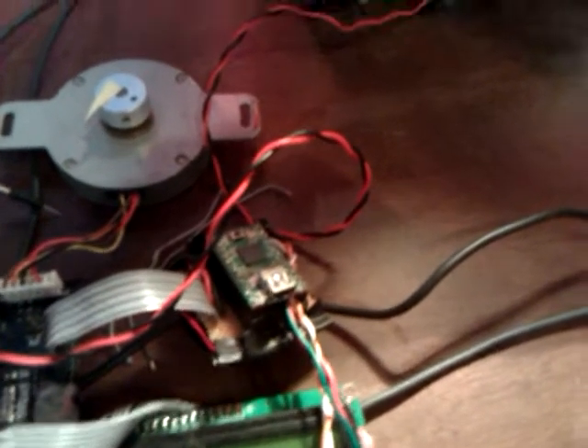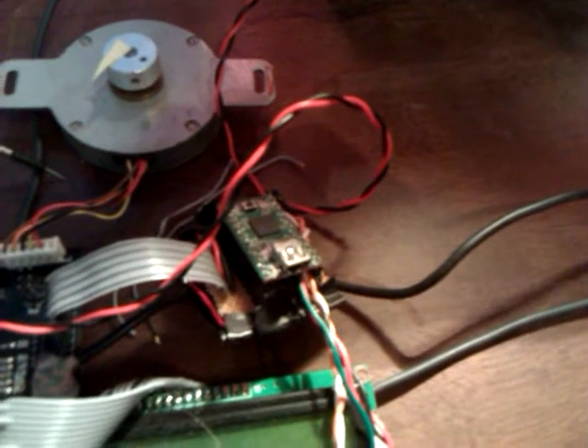What I've done here is, as you see these wires going, I am sniffing the information that the distance measuring device is sending to its liquid crystal display. After I get the information, I decode it and I send it onwards to my controller board.